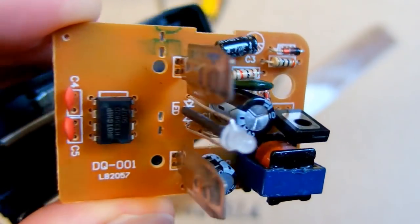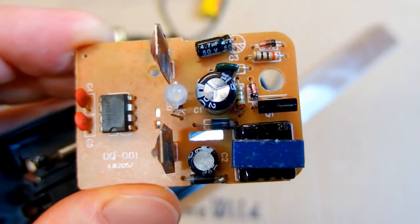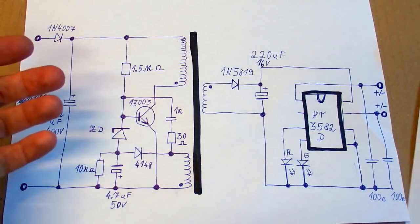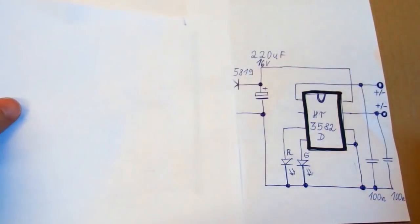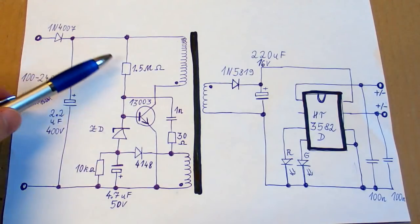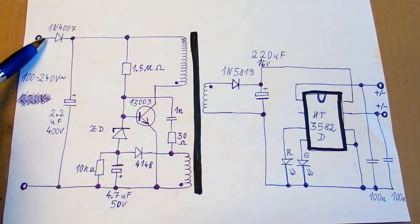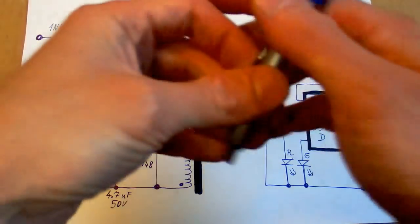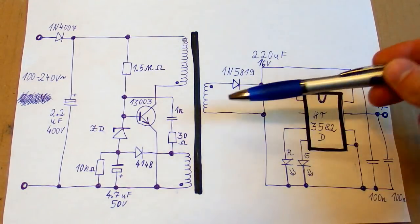As you can see there is a nice line of separation but here it's just far too close, and the other mains contact is right in the middle of all those secondary connections — that's also quite dodgy. We also have no idea what is inside this transformer. I've drawn a schematic and as you can see it has two parts: the power supply and the charging circuitry. The power supply has no fuse, no inrush resistor, no interference filter, no snubber network, very poor board separation, and a questionable transformer.